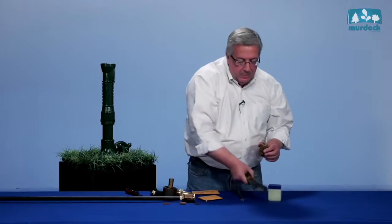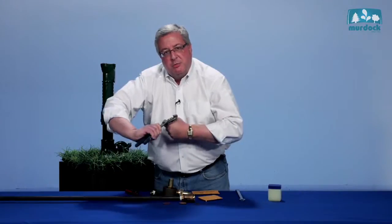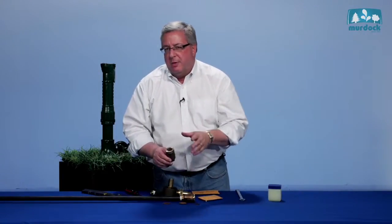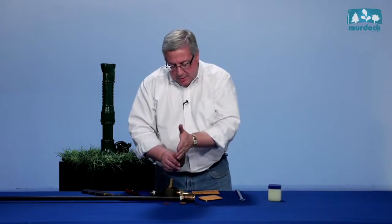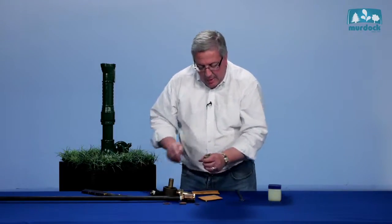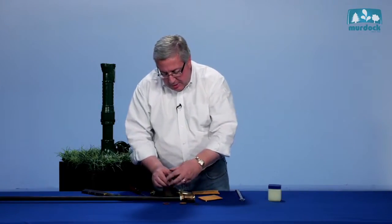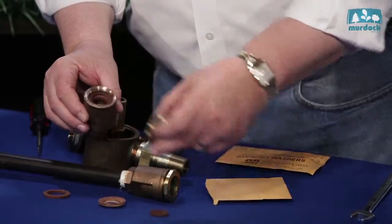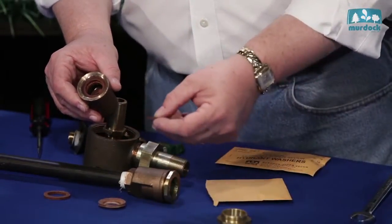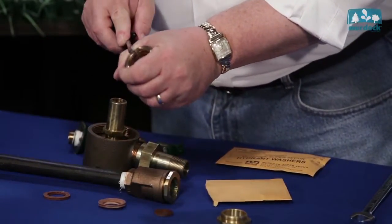What you can do is take your channel locks and loosen this up. Some of the older style hydrants — maybe some that have been in for 40 or 50 years — will have a casting with a slice in it. So you can take your screwdriver and break it apart the same way, just like that. Taking this valve body apart, inside here is a seat cup and ring washer. The seat washer is held in with a screw, and you can take your screwdriver and pry the other washers out.